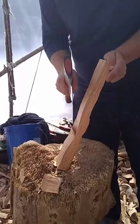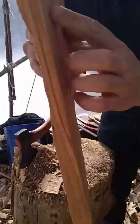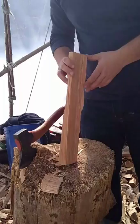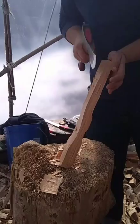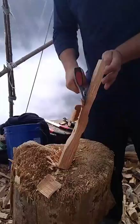The nice thing about doing the crank first in the process is that there are fewer surprises. You can examine the rest of the blank and say, okay, is there going to be room given that I have this narrowness here? Is there room within this blank for the spoon that I want? Not just in this dimension, not just looking at it from here, but looking at it from all sides and looking at where there's knots and stuff. And sometimes you can anticipate that and orient it to take advantage of placing knots exactly where you want them, if you want to keep them, like this one I have in the center of the bowl, or avoiding knots if you want to try and make it so a knot falls to one side of the handle. You know all that information by doing the crank first.